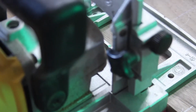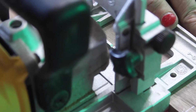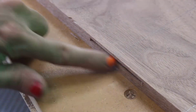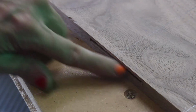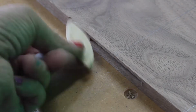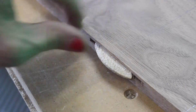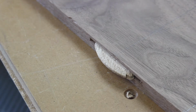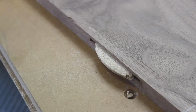And then we will align our lines. So as you can see, we take a biscuit. It goes in there like that, and then you'll have another one. It doesn't add too much support, but it really helps align everything. So I'm just going to do a bunch of these down this row, and then yeah, we'll be good to go. Start putting them together.